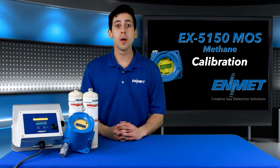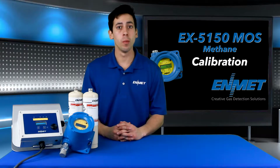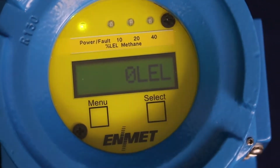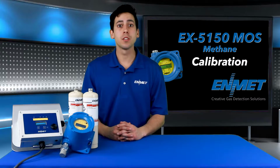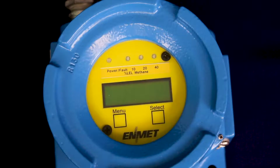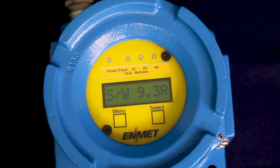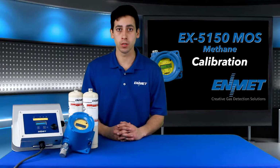In this video, I'll be walking you through how to perform a methane calibration for ENMET's EX-5150 MOS explosion-proof sensor transmitter. It is best to have the EX-5150 MOS transmitters powered up and operational for 24 hours before applying calibration or test gas to them. The sensor transmitter has been pre-calibrated at the factory.